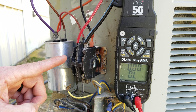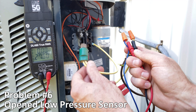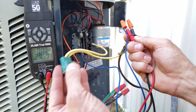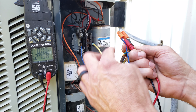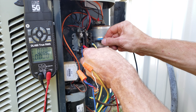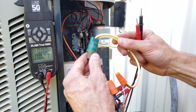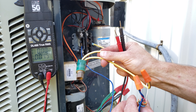With the power off, go ahead and replace that contactor because of the bad coil. Problem number six is a low pressure switch that has electrically opened due to low refrigerant pressure from a refrigerant leak. Even though 24 volts from the indoor unit is present on the thermostat wires, it won't reach the contactor because the wires pass through the pressure switches in the outdoor unit. You'll need to search for a refrigerant leak.